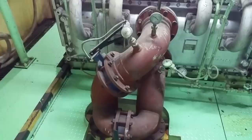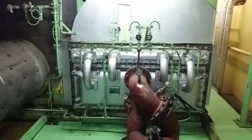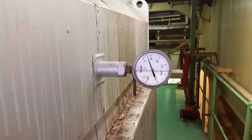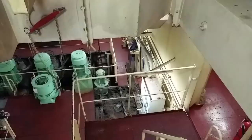The cooled air goes into the scavenge air space of the engine — we looked in there in another video. This is the number one air cooler, which is the forward one. The inlet temperature would normally be well above 100. The outlet temperature is about 36 degrees, though normally it's about 40 — so it drops from well over 100 down to 40 degrees. That's a big temperature drop across that cooler.